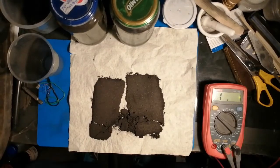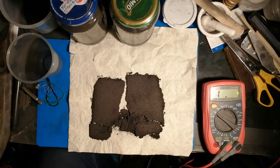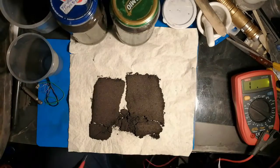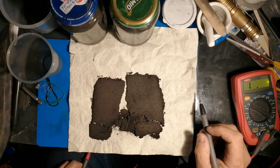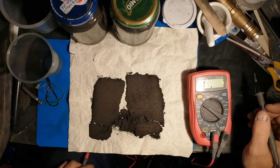I've been playing around with plastics and trying to create a dry coat electrode. I've had a bit of thought about it and I'm thinking there's no point using activated carbon even though it's been graphitized, because the pores are going to be blocked up most likely. So I think the real key is you've got to use graphite.